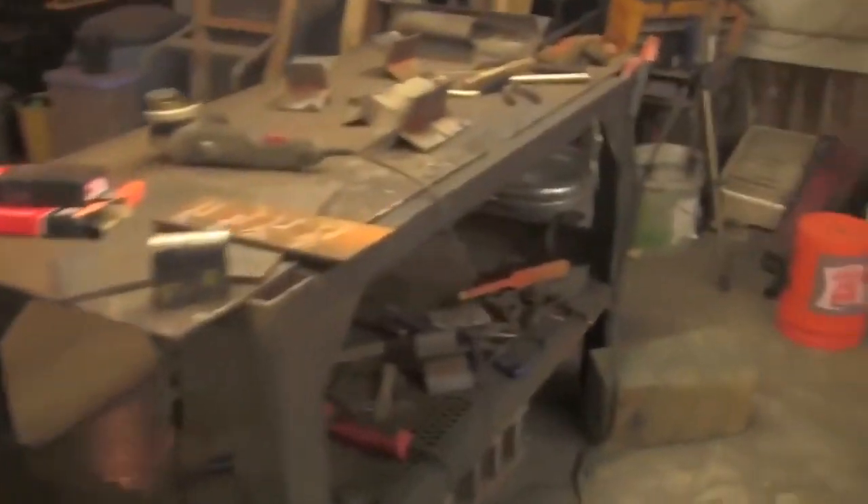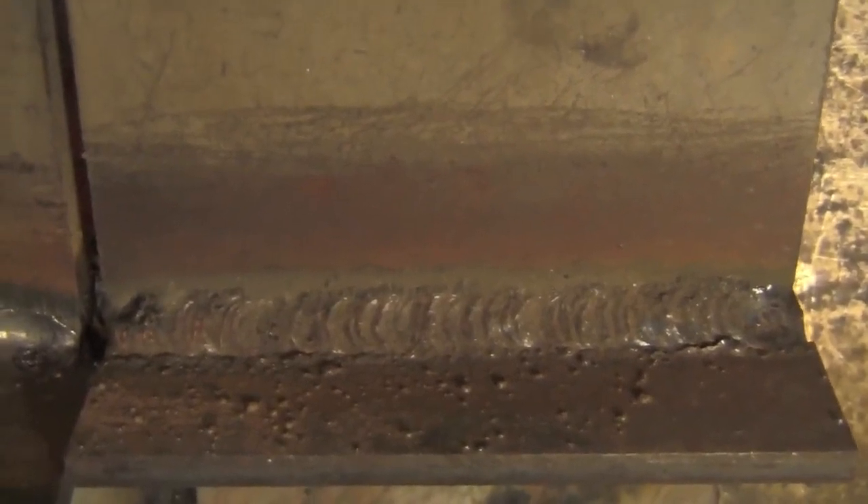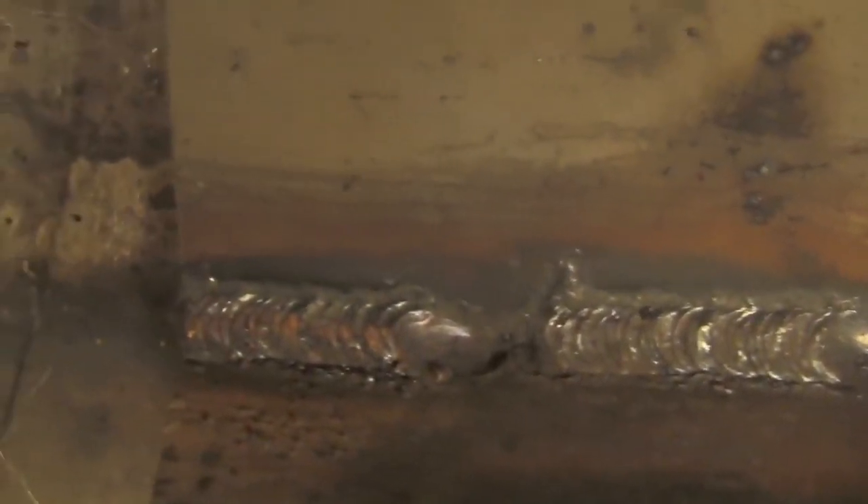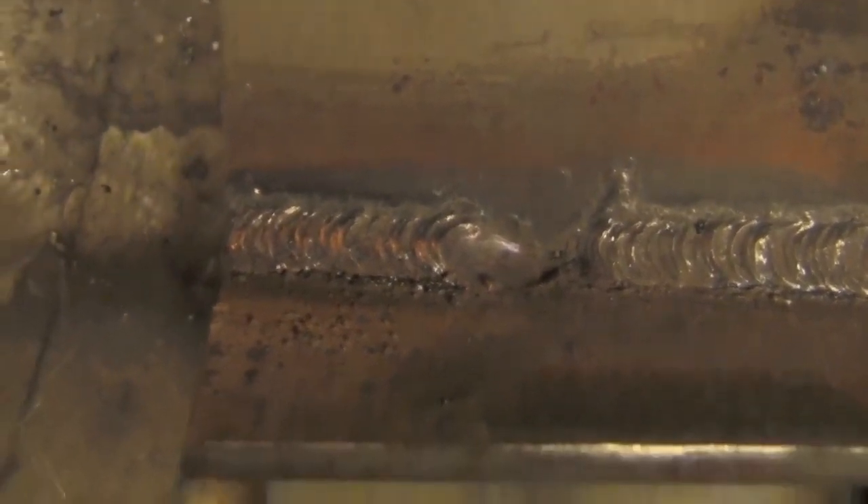That was fun. Let's come over here and take a look at our finished products. On the right we have the lowercase circle thing — not entirely sure if that has a technical name. On the left, we have some whip and pause. Two separate welds — I was trying to get close up so I could only weld so far before I had to stop. A couple things I will say: when you're doing really any motion when welding, especially with 6010 or 6011, consistency is key. Any inconsistencies will show big time in the finished weld bead.